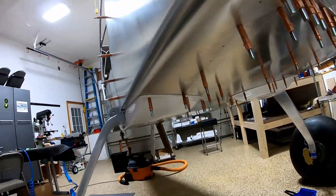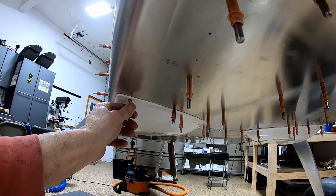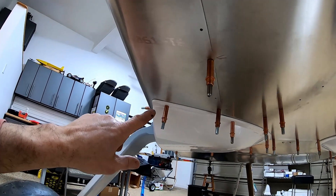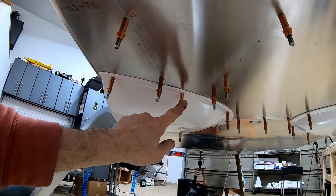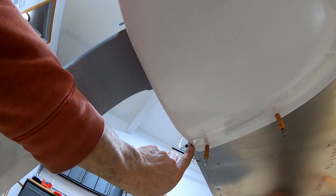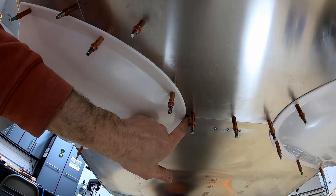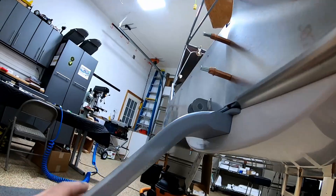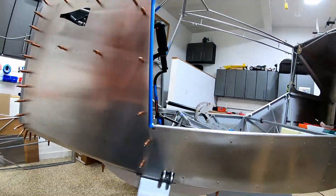I'm probably going to end the belly fairing video here because I don't have the final hardware yet, and we're going to Sun-n-Fun in a few days. For those interested, the measurement formula is: one and a quarter inches from this edge to the center, then six and a half center to center, six and a half center to center — same thing on both sides. I did mark where the skin overlap is and held them up to each other and they matched up pretty well. Hopefully this can help somebody — here's to some less aerodynamic drag. Good night.